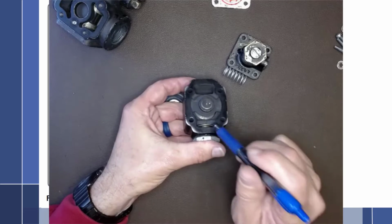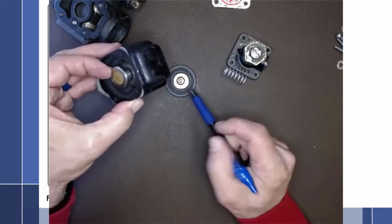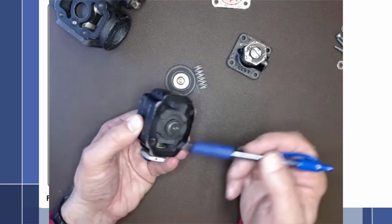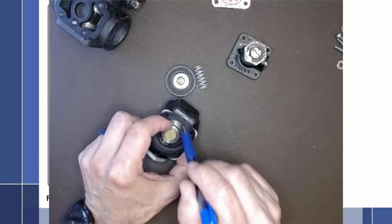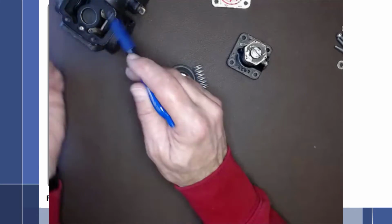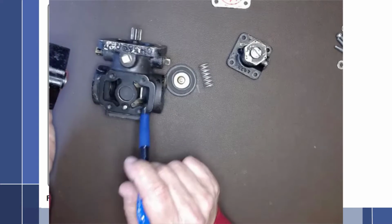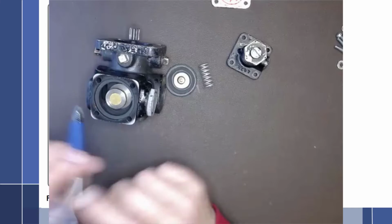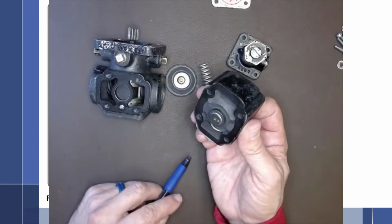Fuel pressure comes in here, pushes on the bottom of the poppet valve, pushes the poppet valve open against the diaphragm and the spring pressure, and then is allowed to come through the bottom of the poppet valve and now out through here. So again, it comes in this way, poppet valve opens, comes into this chamber, which is now open down there, allowing the fuel to come this way back to the inlet side of the pump. So this would be the outlet side, comes up, around, back to the inlet side of the pump. So it just recirculates right through there. And by the way, if I put this on this way, then everything is just reversed. This becomes the inlet side of the pump and everything works the same. It's just the pump has to turn in the opposite direction.